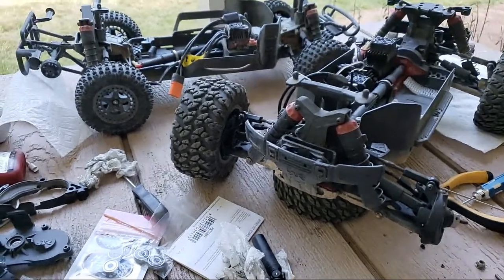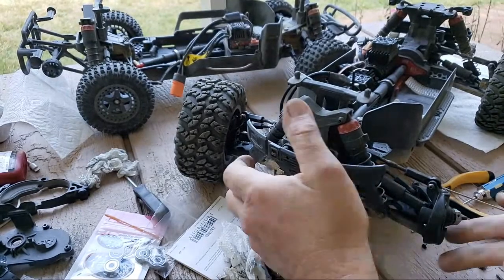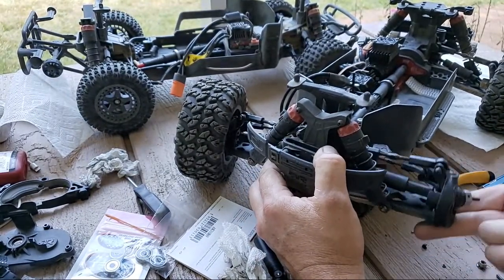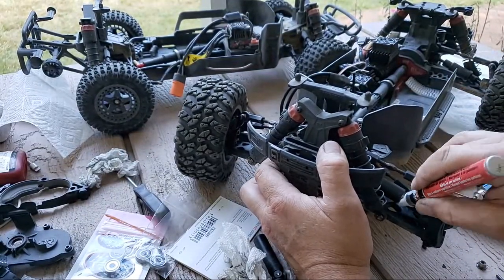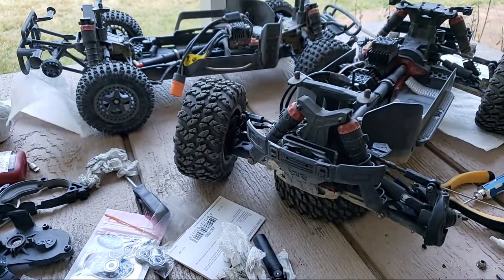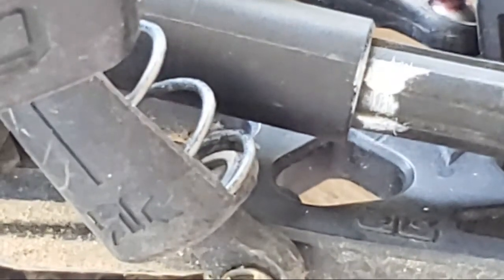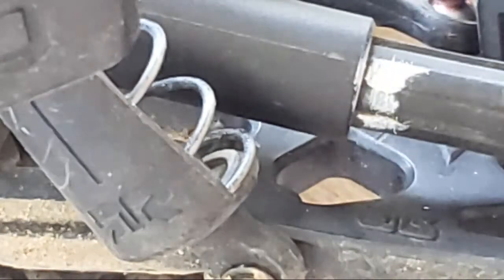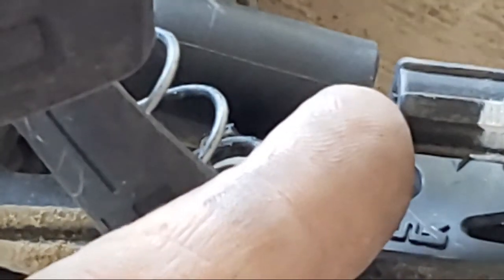All right. Now, see, this is fully seated, right? Basically, it's fully seated. And obviously, the further you bring it up, the more it's going to kind of slide in, but it's very minimal. So I'm going to take my paint marker, and I'm just going to go like that. And you can see that's basically marking the edge of where that slides into, right? So now if I pull this out, let's see how much material is actually sticking in there. 1/2 inch? Literally 1/2 inch.